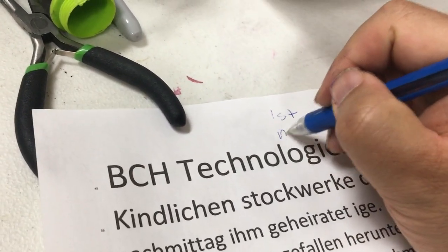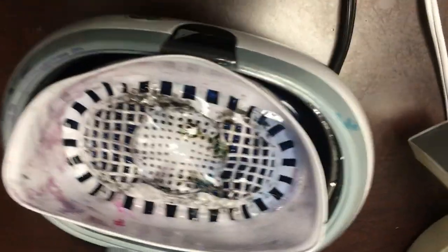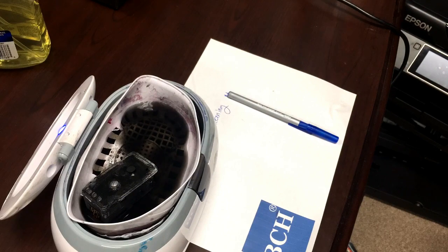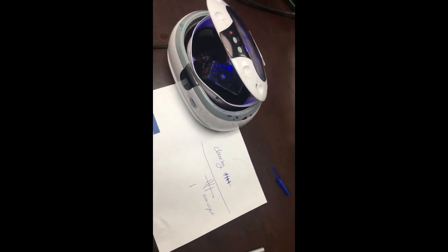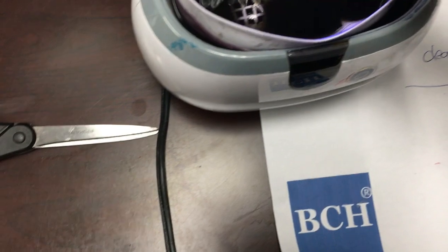We'll mark it as a first printout with no cleaning. We use a little cheap cleaner we bought from eBay. You always want to use a basket to suspend your printhead right on top of the bubbles. We ran a cleaning on the first day, then left it overnight — this is the second day. We did 20 cleanings total, 90 seconds each.